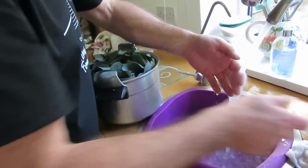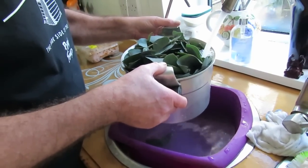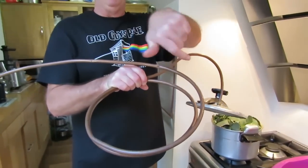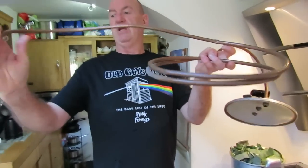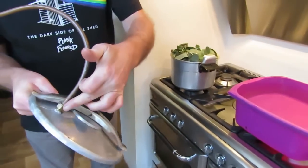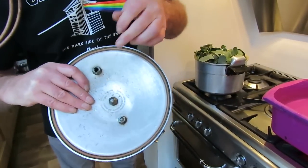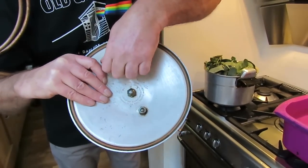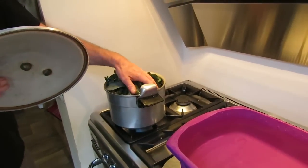You can use water from your hot tap. Once you've filled up your pressure cooker, add as much water as you can get in, leaving a little bit from the top. We've used a 10mm copper tube which we've coiled around — you can actually buy this copper tube, it's called microbore tubing. You can buy it already coiled, and all you would need to do then is refashion the two ends. This end goes into the collecting vessel. We've used a single 10mm compression joint and placed the nut on the back with a gasket, and that actually forms a very good seal.